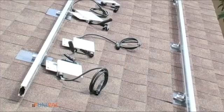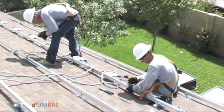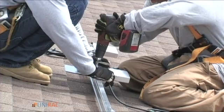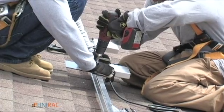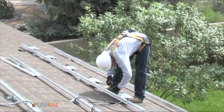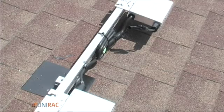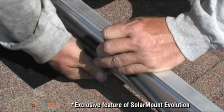Popular these days for many reasons is the microinverter. This is a smaller sized inverter that is mounted to the beam right under the module or modules it is servicing. The contractor simply affixes mounting brackets of the microinverter to the beam in between his module marks, then attaches the cabling system supplied with the microinverters. Handling the electrical wires to ensure a clean looking array is important, and those wires, if not collected and fastened, could chafe in the wind against the roof, leading to serious customer dissatisfaction. So the contractor uses a clip provided by the mounting structure manufacturer.